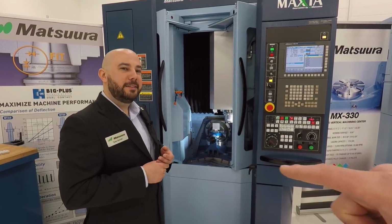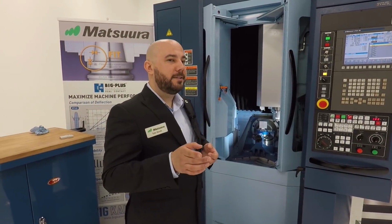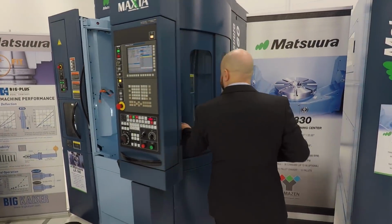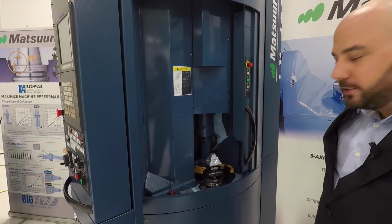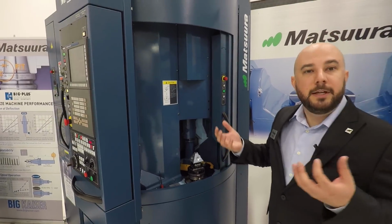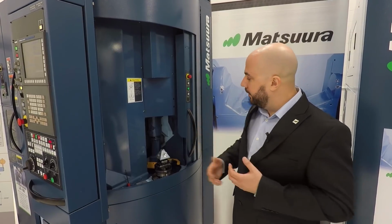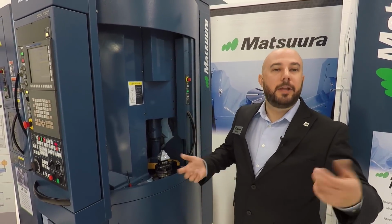You do, like the one we saw when you and I were out in LA had a built-in 42 pallets. This actually does. It's got 2 pallets. Oh, look at that. It's so small. That's kind of cute. So if you got a longer running cycle time, again, maybe 6 to 8 hours where you're doing a lot of finishing on a bigger part, load one up before you go home, push start, come in the morning, you're getting an overnight run.